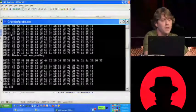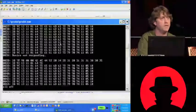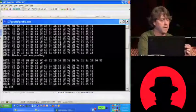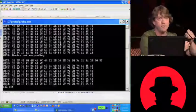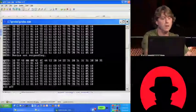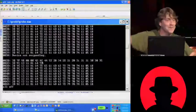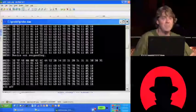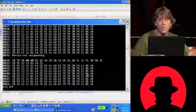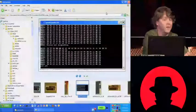And so ATR is coming out of the chip, and I'm just sitting there with a needle down on D0, and I'm taking the other end, I'm not even using a buffer, the end of a coax line, and I'm shorting it on ground. And so it just literally like this as it's resetting. And lo and behold, all of a sudden on reset 3B, the ATR changed. Well, guess what? That was the bootloader ATR. And so I glitched it back into the bootloader using a simple, my hand with a probe in my hand. It's crazy, but this is a secure smart card from a Chinese manufacturer.